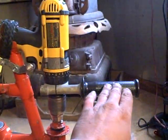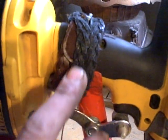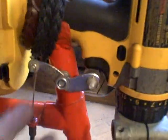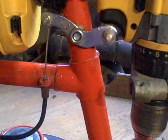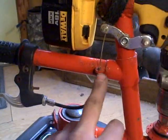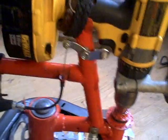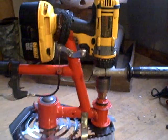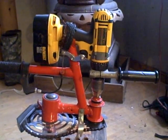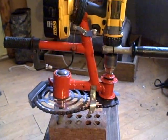It has two handles that you can hold onto, and it takes the weight off of your drill. Right now I just have a leather strap holding the drill on — I want to get a Velcro for a nice tight fit. Here's my actuator. I put the drill on safety to show you — it goes up and down. There are adjustable cables on both sides to help take any play out. This conversion fits an 18-volt XRP. If I wanted to make it fit another drill, there would be a few modifications needed. But being a contractor, I have several of these drills and plenty of batteries, so instead of buying a gas auger, I decided to make this.